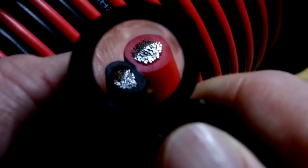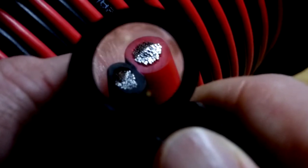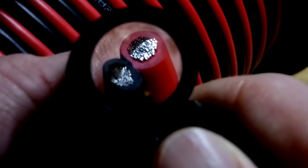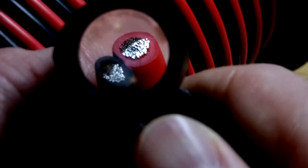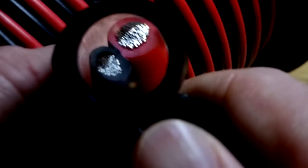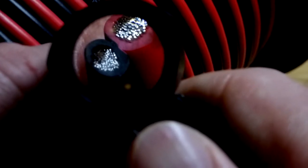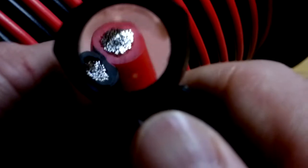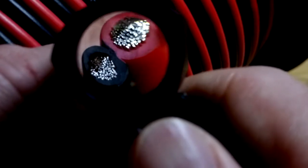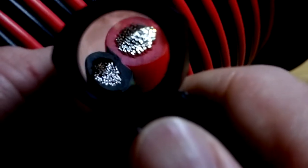The simplest way to tell that it is probably copper clad aluminum — you can see a silver colored metal there. That is probably aluminum, and a brown colored metal next to it — that is probably copper. Wherever you see that aluminum, it should be surrounded by copper. But once you can see that silver color, that's being exposed to air and it is oxidized.